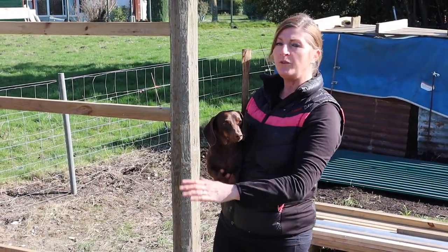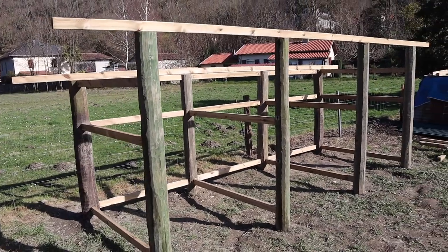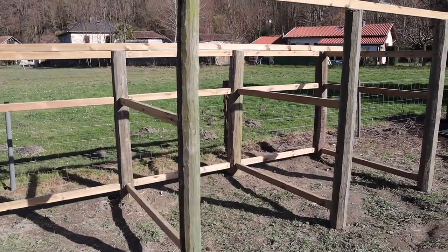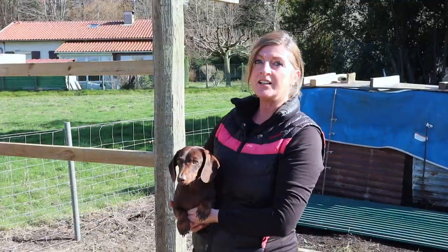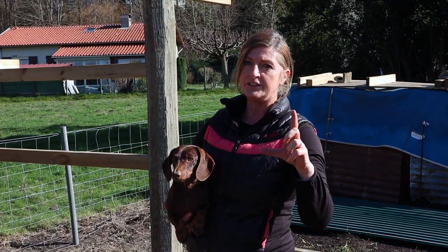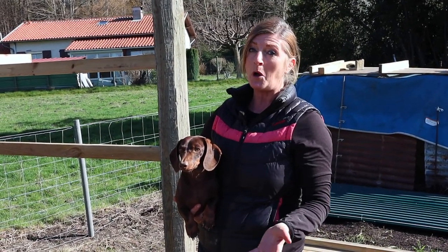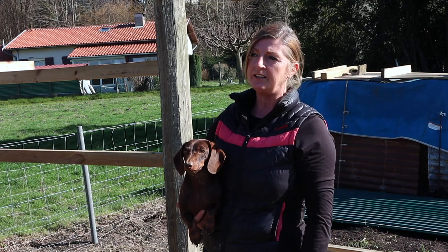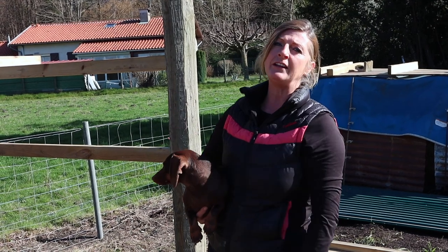Sunday afternoon, and we've finished the main framing of the compost bins. There's three bins, each 1.20 metres wide, which is just a little bit wider than the bucket on our little tractor, and they're 1.50 deep. As I said, it's Sunday afternoon, and typical, we've run out of the long screws that we need to secure the rafters and the top plate. So unfortunately, we can't continue today. Tomorrow morning, off to the builder supplies, and then we'll continue. But the siding and the roof, we'll put in the next video.